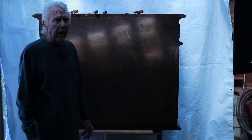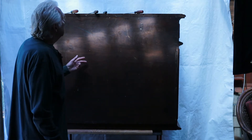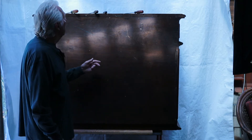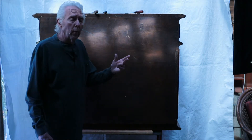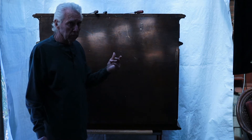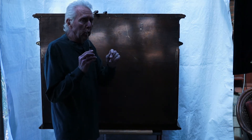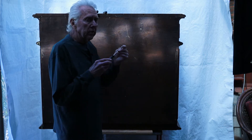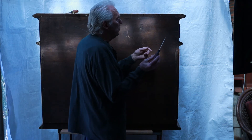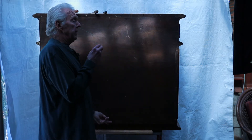I need to take the back off because that's the only way the shelves are going to come out. You may have noticed I have four different screwdrivers here — the reason is I want to get the screwdriver that fits the screw head the best. Some of these screws have been out before and are a little boogered up. The point of having a good screwdriver is to have four really good points so it's not going to slide around inside the slot. I'll try each one and work from the outside to the center.